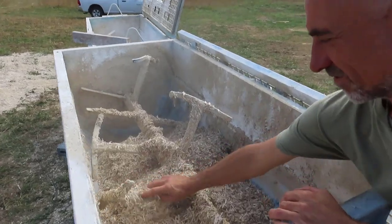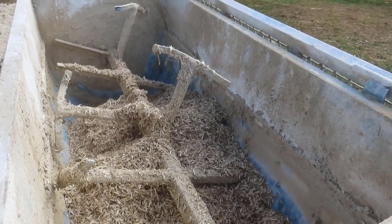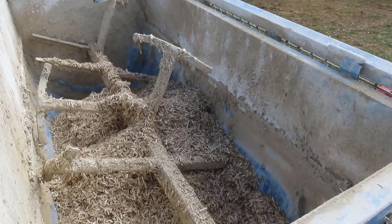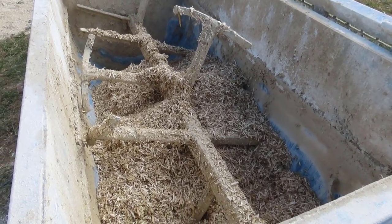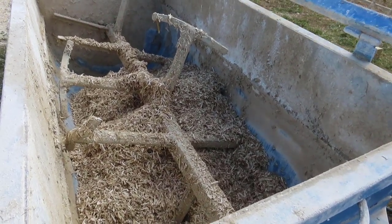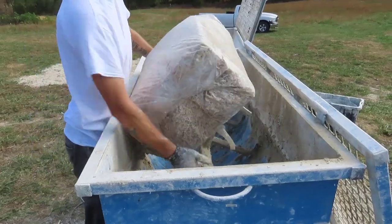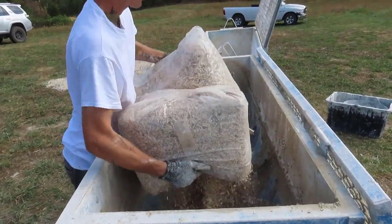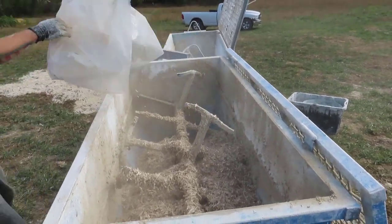Even though it looks low-tech, what we're really doing is creating a high-performance building envelope. Since the industrial revolution we started building with one thing in mind — to keep moisture and vapor out of our indoor environment. What we're starting to realize is that eventually Mother Nature prevails and water gets into the walls. Once that water can't get out, it mixes with all these toxic building materials, starts to mold, and creates a really unhealthy indoor air environment. But when we build with a material like this that's vapor-open, we're working with the elements. With hempcrete, the hurd is very porous, and combined with the cementitious binder, it brings together a whole slew of properties that create a really good air environment.